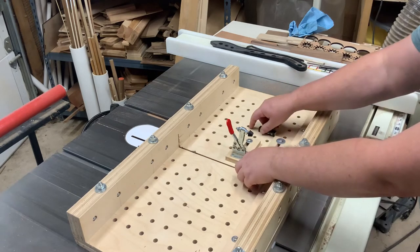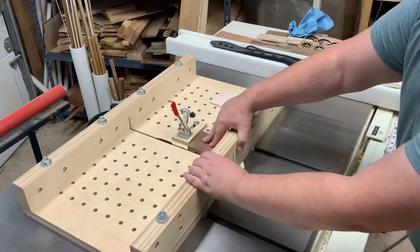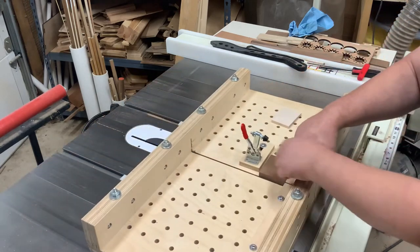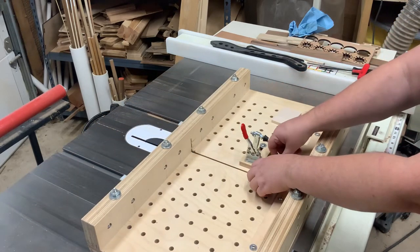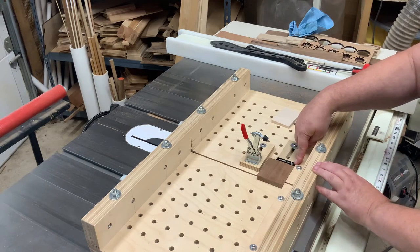This being three inches, I've already aligned it with my blade, so I can see that my blade is right up against there. And I want my rabbet to be about a half-inch. So just dropping one of my half-inch setup blocks in here.